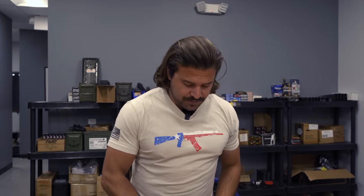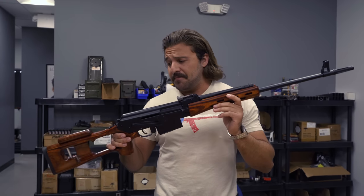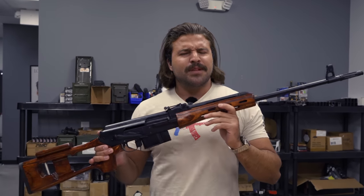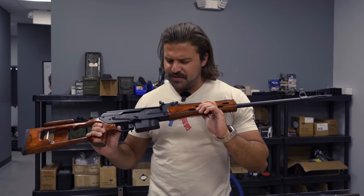I'm going to show you something real cool before we go. This here is the beginning of our bump rivet — or in this case, more of a bump pin. A bump rivet is something that's been showing up in AKs in the last couple of decades. It's a new way of camming the bolt or starting the initial rotation of the bolt into lockup. I mentioned that 30-06 AK before — well, this is it. It's kind of neat to see the AK returning to its 30-06 roots that it started with, with the M1 Garand.